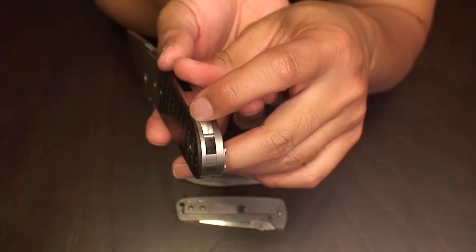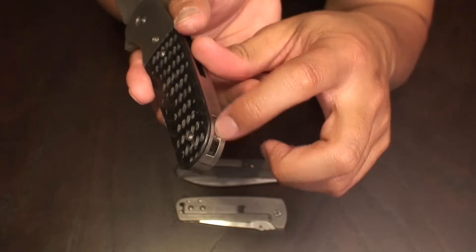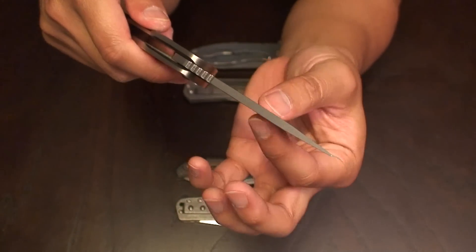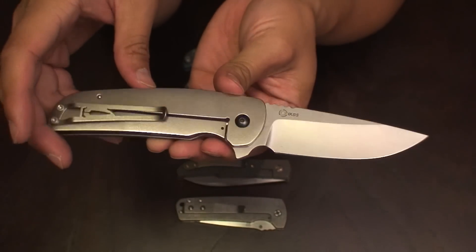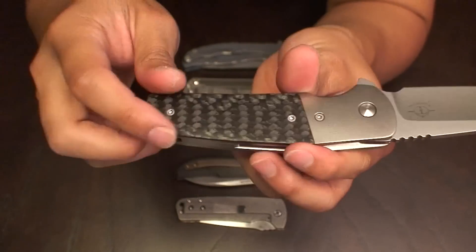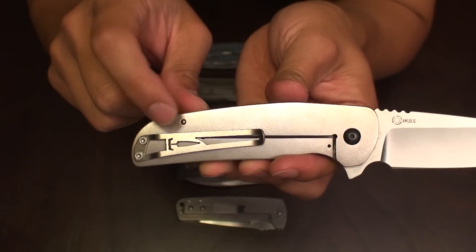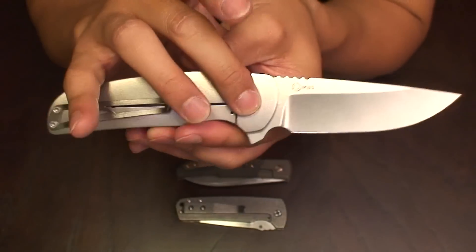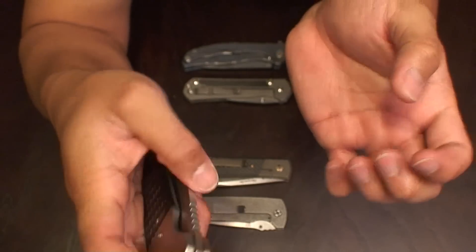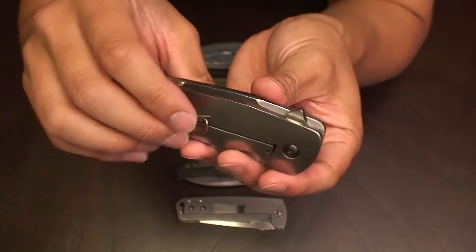You can see how the backspacer is milled out here to facilitate putting a lanyard in should you decide to do that. It features a really nice and thin hollow grind on the blade. There is a screw hidden from the scale that comes out here — that's really the only hardware showing that holds this knife together, outside of the pivot. On the flipper area, you also have a knife relief cut on the frame which really allows for comfortable flipping.